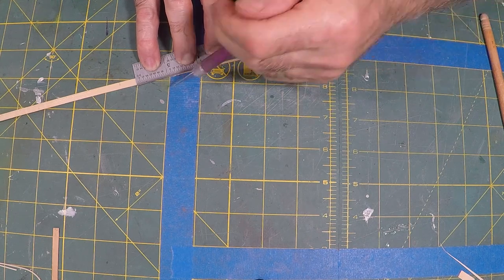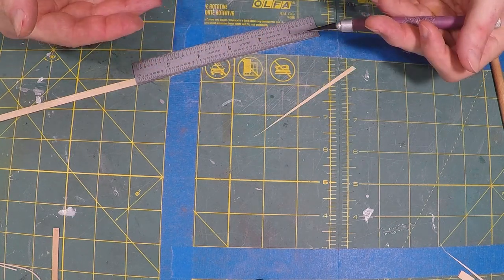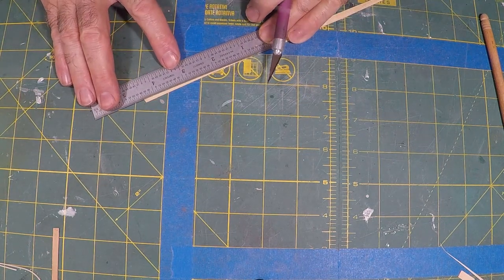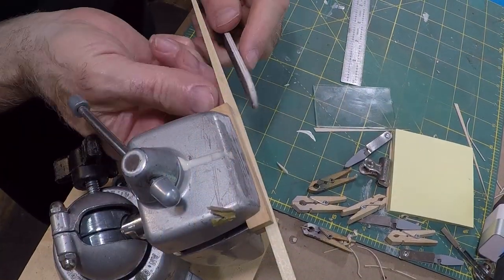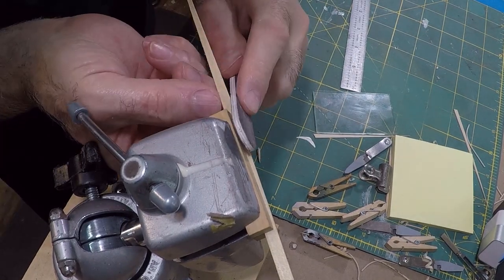After making several light passes through the plank for a cleaner finish, we'll be left with a rather sharp transition. And before the plank can be installed, we have to deal with that. And it's easy enough to do. I just use an emery board to blend in the two areas into the full width of the plank. Holding it in a vise makes the job quick and painless.